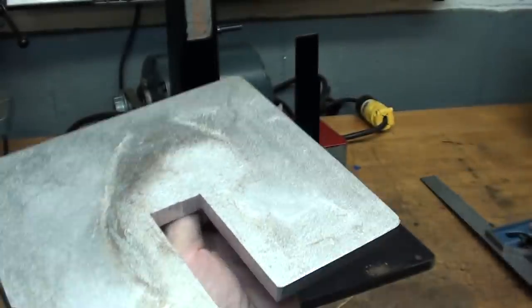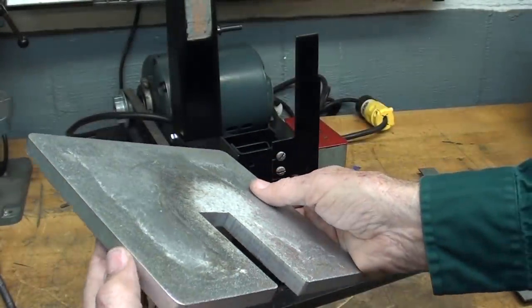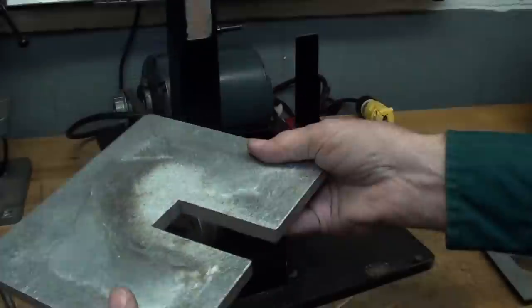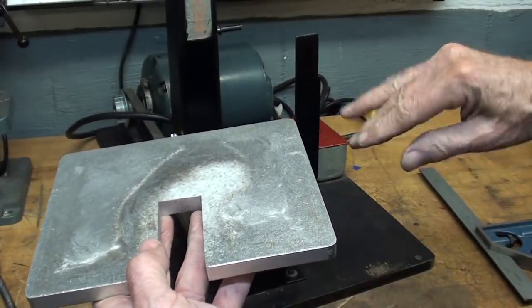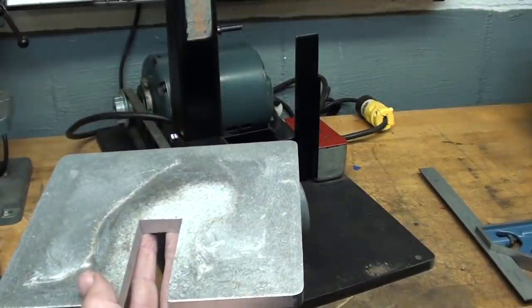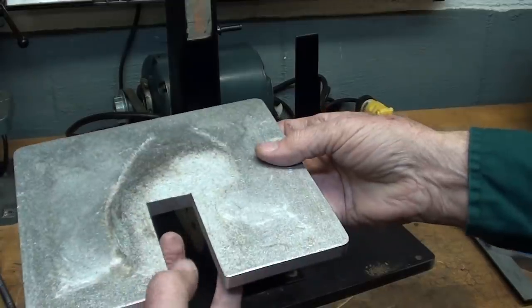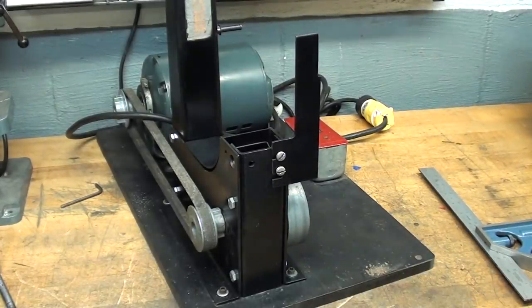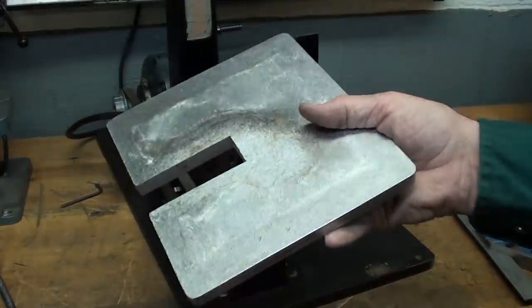At the high school, we did machine these, as did Mead. I think I might have said that. And on a large enough lathe, this could be held in a four-jaw chuck and faced off. Some of the ones that we cast had extra lugs on the side, four lugs that could be used as hold downs, and we would sweep this with about three passes of a fly cutter. It came out pretty nice. I'm not going to do that for this purpose because an abrasive machine is kind of a semi-accurate machine to start with. The kind of work you can do on here isn't all that accurate, so the table doesn't really need to be.